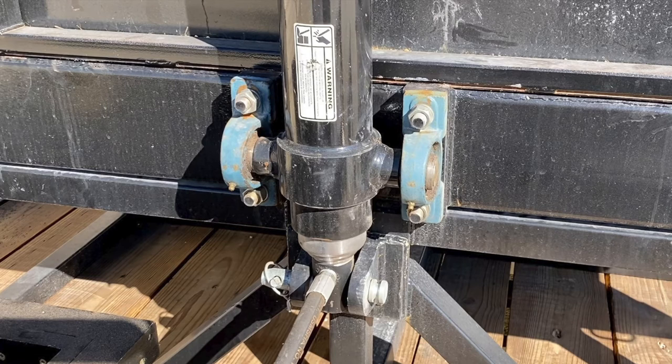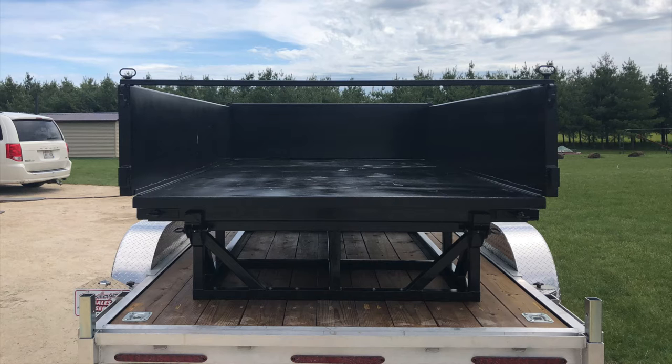Here's a look at how the ram mounts. I've got a 108-inch telescoping ram that will basically run out three sections as fluid is pushed into it, and that's detachable so I can store it separately. The back section has a cross bumper on top that keeps the sides from pushing out, and that's of no significance when you're dumping loads because everything kind of falls underneath it — I noticed that with my trial dumps.